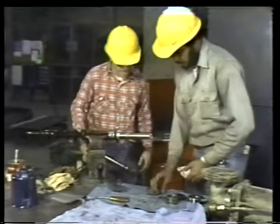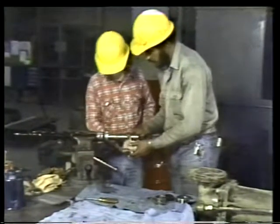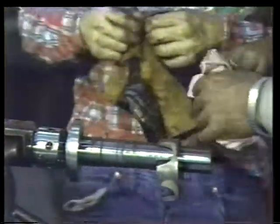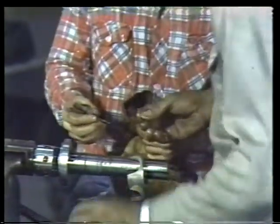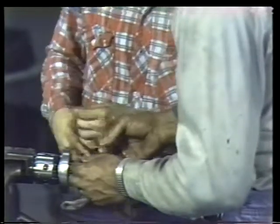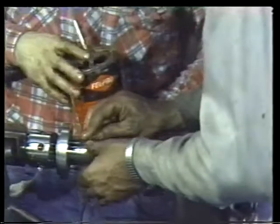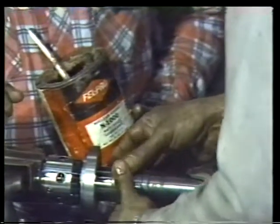All the parts of the new mechanical seal are now in place. Next, the bearing spacer is slid onto the shaft. Then the split retaining ring that forms the inner seal for the bearing should be wiped clean and assembled in its groove on the shaft. As we mentioned before, assembling split retaining rings is often tricky. Even with experience, it might take you several tries to get the halves properly locked together.